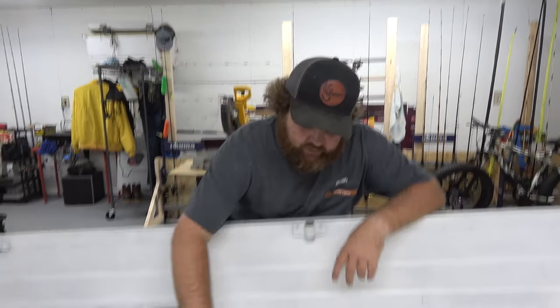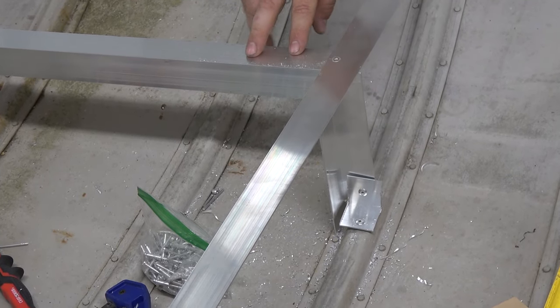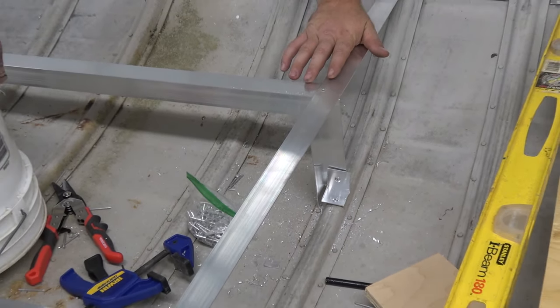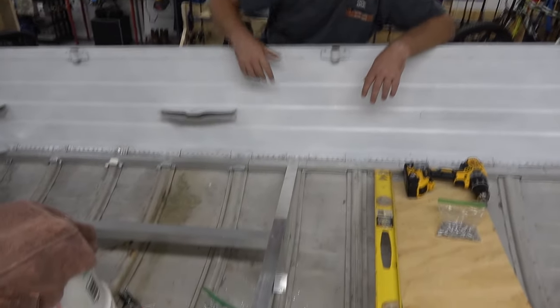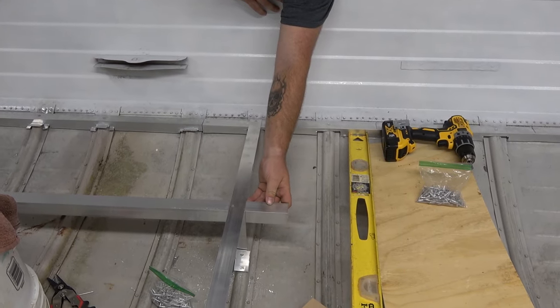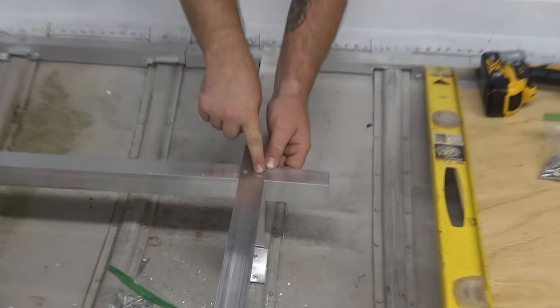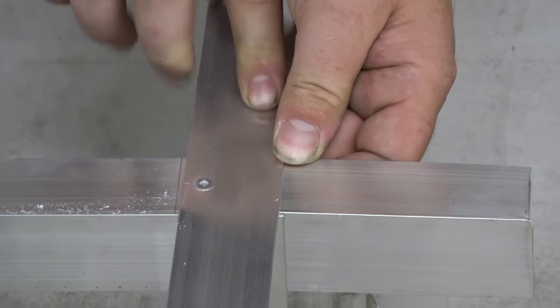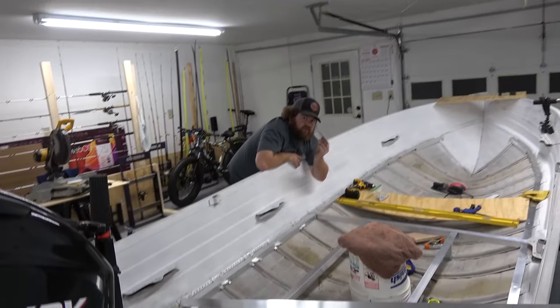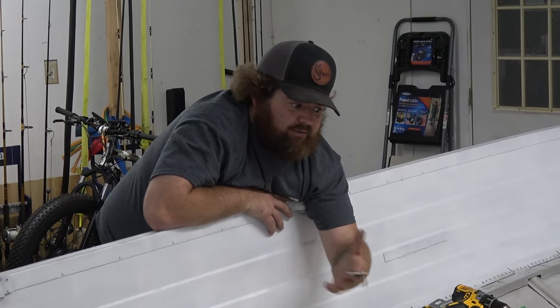Yeah. So in order to do this, because of how we did the back and everything, we did the sides first. These have to be up under our cross braces. So it should stop essentially halfway under this cross brace, cross piece. The reason we did that is so that when we tie in, we bring this back under here and butt it up with this piece, and we can rivet it here, and that way it's still supported in the middle. If we do change our mind, it's as simple as drilling out a rivet, which you've done a couple times already.